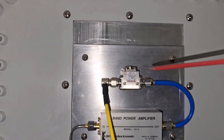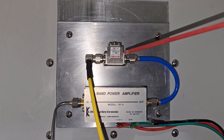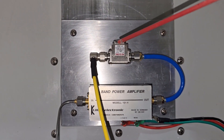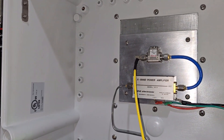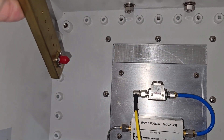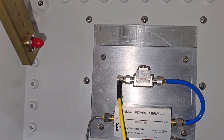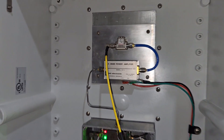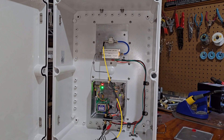That 220-230 milliwatts is enough to fully drive this 2-watt amplifier, which I got as part of a package deal of 10 GHz equipment quite some time back. The output of the amplifier goes into an isolator to protect the amplifier in case something happens with the antenna SWR — if something goes wrong with the antenna or maybe it gets encased in ice and SWR goes up, this will prevent reflected power from getting back into the amplifier. Then we come out of that; this yellow cable would go to the antenna. Hopefully the slot antenna will get mounted through the top of the box with the SMA connector fairly close to the RF output of the isolator — I'd only need about a six-inch cable to connect to the antenna and keep losses down. That's the one part I still need to do: mount the antenna, and then Quick Beacon will be ready to go up to the hill and be mounted on the tower.